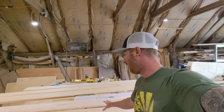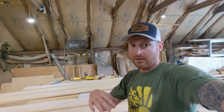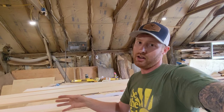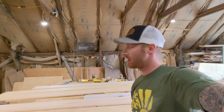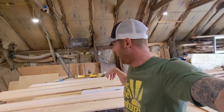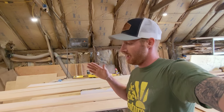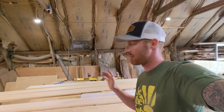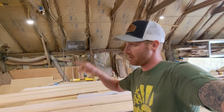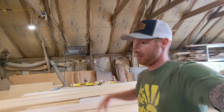The entire crib is going to be hard maple - all the way around the outside. It's actually going to be solid wood on three out of the four sides. A lot of cribs just have typical slats all the way around, but this will be solid wood on the front, back, and foot end. I'm going to cut out a 45-degree angle in the front and then do slats across that section. Here's what I'm starting with.